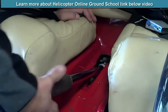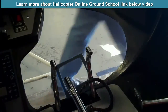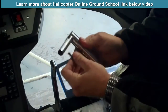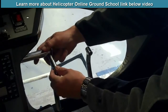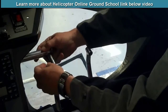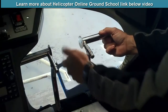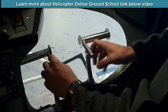On the pre-flight, we release the collective to make sure it's all working and firmly in place — pin's in there. Now we'll move on to the pedals. With the collective firmly in place, we're going to reinstall the pedals. We put the pins in here when we remove them so we don't lose them. Take them back out and insert here — there are three different positions; the center position works pretty good most of the time. Put the pin through with the holes lined up, then put the locking pin in so it won't catch on your feet. Slide in to center position and lock the pin in nice and secure.